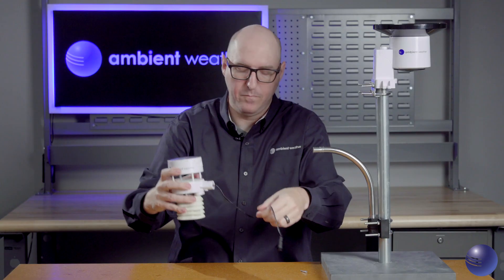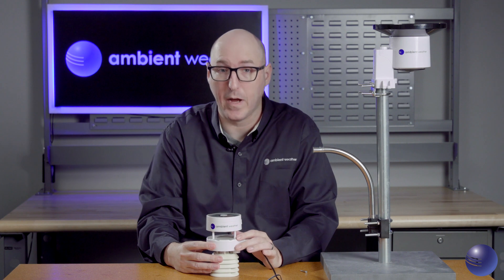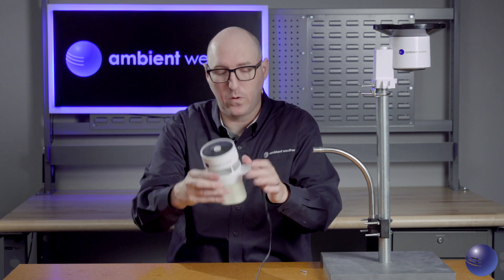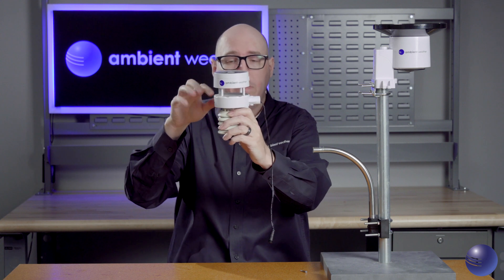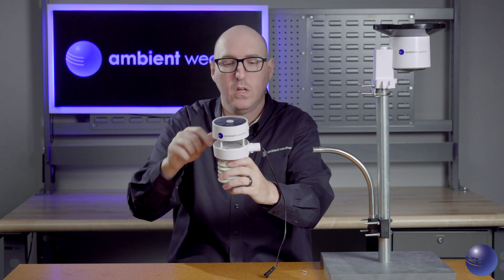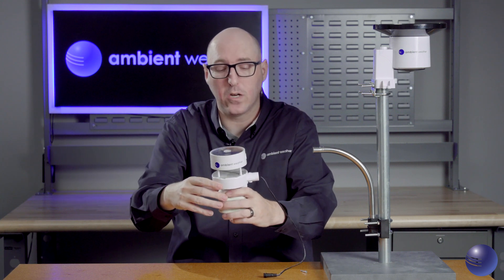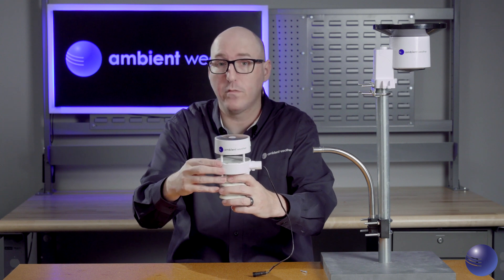Make sure you hold on to the heater cable. Now, with the anemometer in hand, we're going to perform a visual inspection. We're going to look on the inside, checking the sensors mounted to the top of the sensor as well as the mesh screen. We're checking for undue wear and tear, corrosion, and any bent edges on the screen, because this can affect your wind readings.